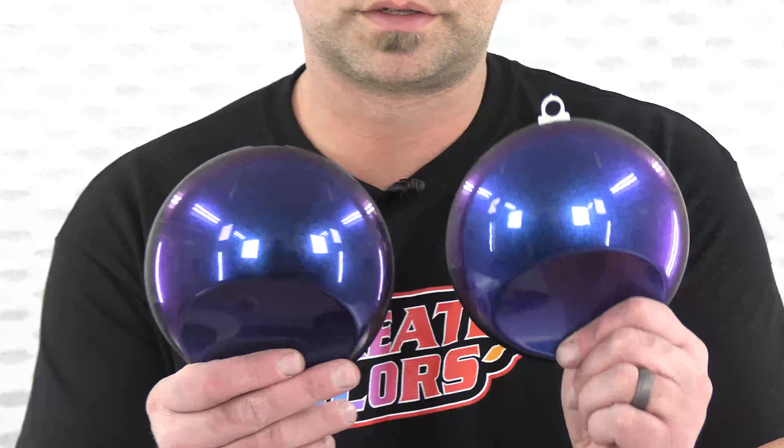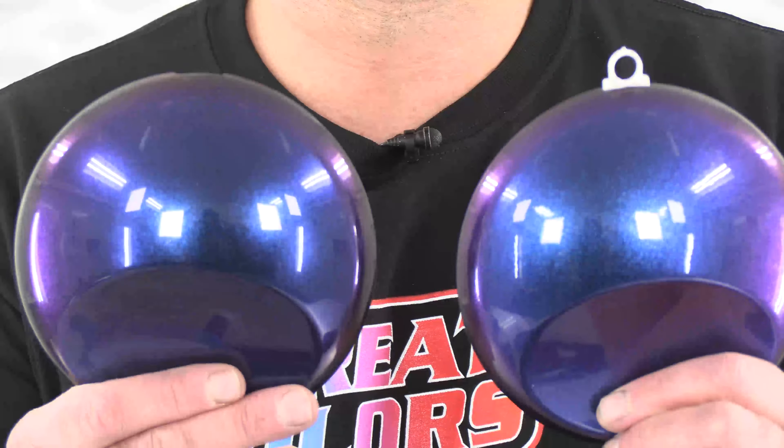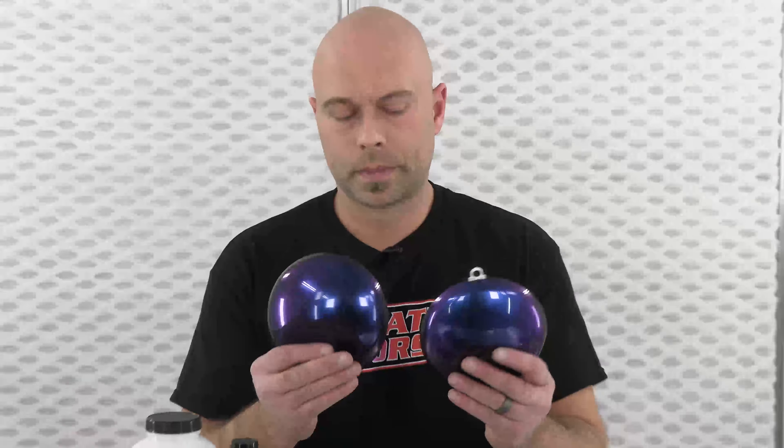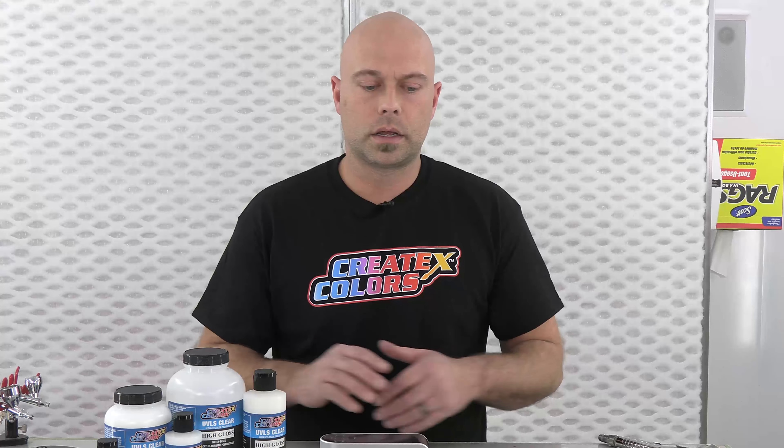The higher angle is for flattened satin finishes, so the 20 and 60 degree angle is what we're actually measuring. We're not just looking at this by eye — we're measuring it and comparing it to other products. While developing the 4053, we were comparing it to a 2k urethane, which has always been the standard for show-level gloss. I have in front of me a 2k over a flare blue violet color and our 4053 over the same color, and we are very pleased with that level of gloss.